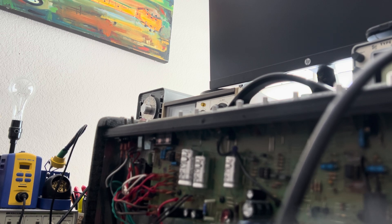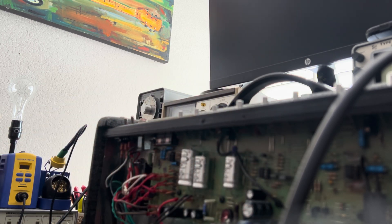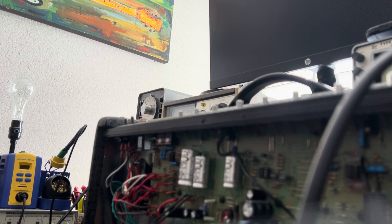Due to the limited current through the supply — at least for U3 — I'm able to use a run-of-the-mill TL072CP. That'll win the day. Let me get her buttoned up, then we'll do a final test with the guitar. And let's check the footswitch, because lord forbid something else surprises us.